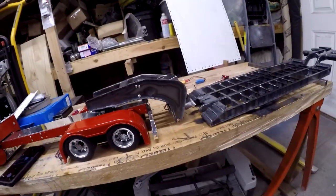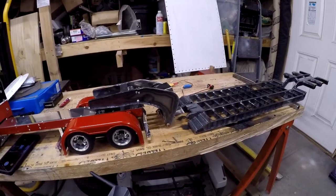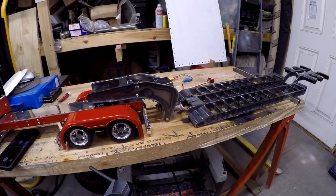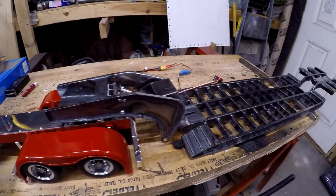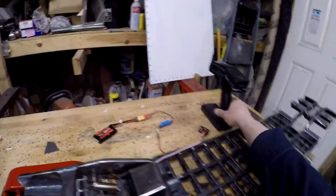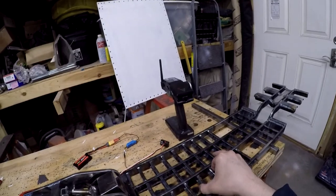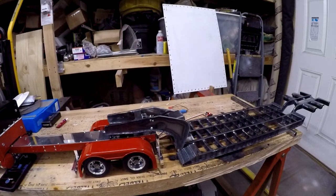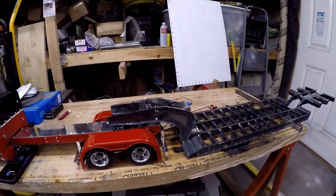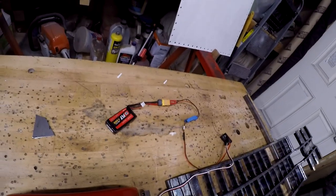There you go — you can see the foot is engaged and this is off the ground. Now let's set it down with one forward movement. It's down. Now back the truck into the trailer — there's no weight on it — truck engaged with trailer. Now let's keep running it up and the foot comes up off the truck. Spring is still in place, fully retracted.